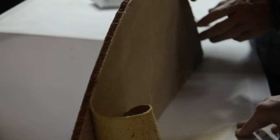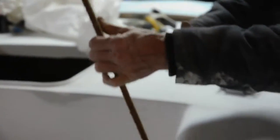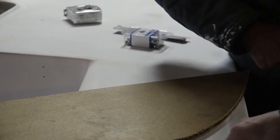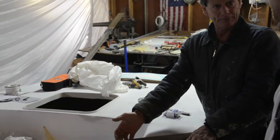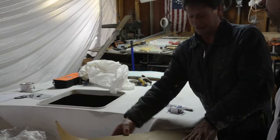So another thing that we used to do when we would build things, like say we wanted to attach a bulkhead to another bulkhead. If this was a square cut, route this stuff away a little bit, and then take some of the material. I can show you upstairs. We would make a rope out of carbon usually. Stuff it in the groove, so it ties your skins from the inside. You're not adding bulk to the outside.